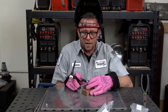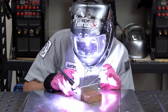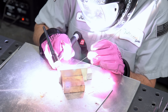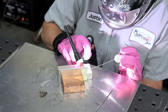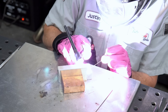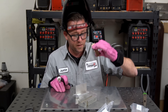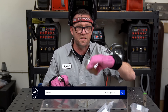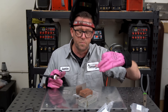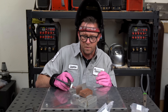Unfortunately I'm not going to be able to get you an arc shot on this one because it's way too tight to get in there. Same rule still applies — we're going to focus in on the thicker one, let the pool build onto it, and then slowly direct it downward until I get a pool on the thinner material. I'm going to drop some of this 0.045 filler into it. I'm going to point out this copper block here — it is not being used as a heat sink. It's being used as a weight because this is a 321 block from Wild Metals Online. It's solid copper, weighs almost two pounds, and it'll weigh this coupon down. We're not cheating — it's just there so I don't poke the part and move it around and can keep the camera still.